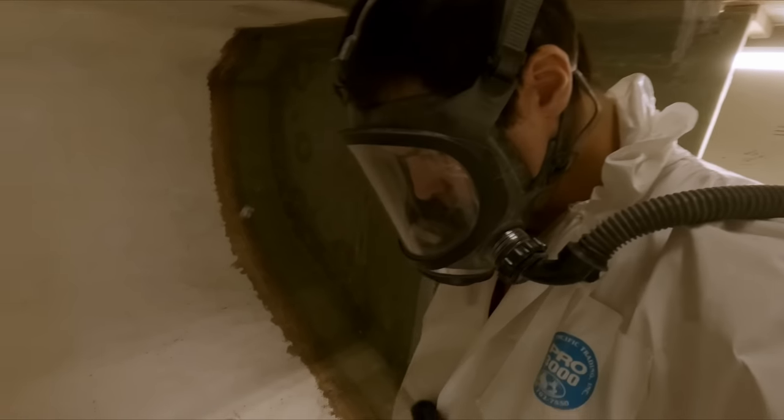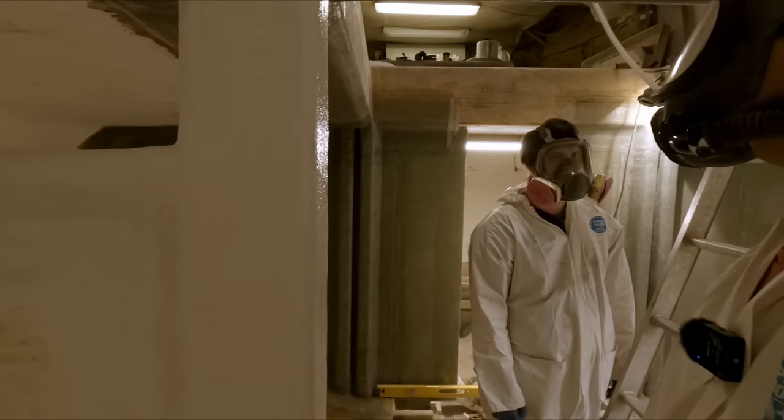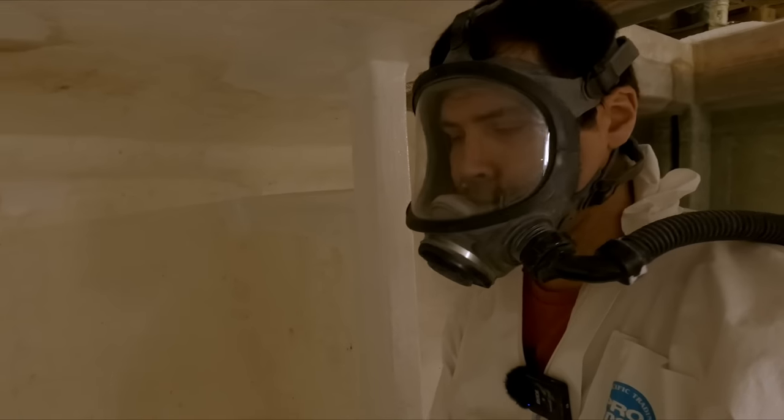All right everyone, so down here in the hole for another edition of Gel Coat Fun. So, just got this divider done. Looks really nice. Working on the sump now. This gel coat gets two layers. I guess the first coat is the flow coat, and the second layer is the gel coat. Or the first layer is gel coat without wax, and the second layer is what they call a flow coat that has wax included. So, two layers.